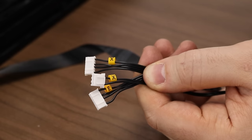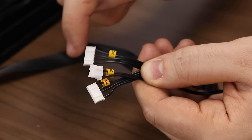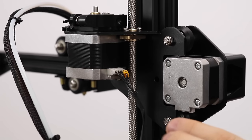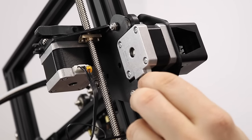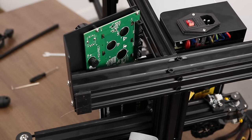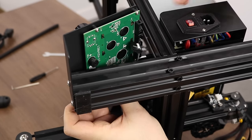It's cable time! We have one wide 6-pin x-axis connector and a smaller 3-pin one. The 3-pin connector connects to the x-axis end stop, while the 6-pin one connects to the motor. The 6-pin E connector connects to the extruder motor — take the connector labeled E and insert it into the 6-pin extruder motor, pushing it in evenly. Next take the 6-pin x-axis connector and insert it into the x-axis motor. Finally, use an Allen key to help connect the 3-pin x-axis limit switch to its connector. For the LCD, connect the display cable to the third connector on the back of the LCD, which is the closest to the inside of the printer.